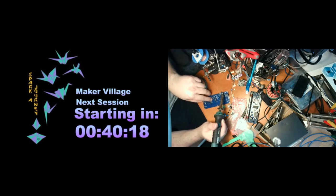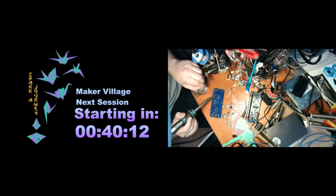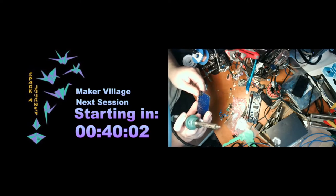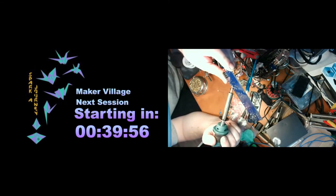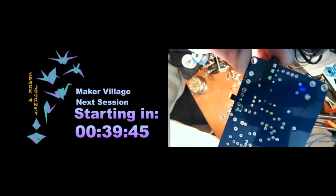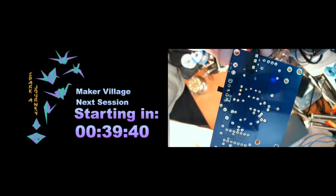With stuff like switches, sometimes it's a little harder to solder because they have a lot of metal to sink the heat away from your soldering iron. So it can be a little bit of a pain. You got to get that metal a little hotter to get the solder to join. But you also want to make sure, might have a bridge there. We don't want that. Especially with things that are really close together, like you can see that switch and there's a resistor right there. Yeah, they might be bridged.